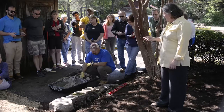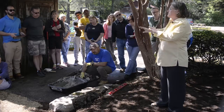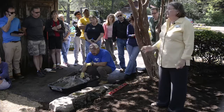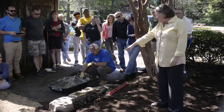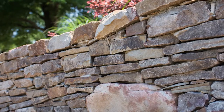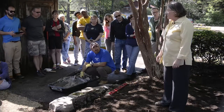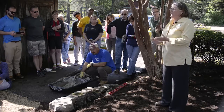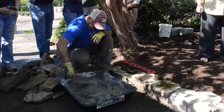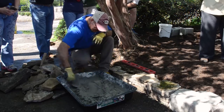When you're doing a mortared wall, it's really important when you open your pallet to separate your pieces — smaller pieces to one side, larger pieces that you're going to use for the cap set aside. Always try to identify the most beautiful pieces. Pull out some of those really special larger pieces and set those aside to use as your top.